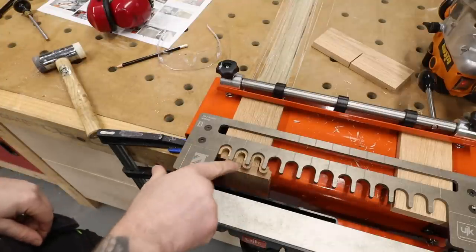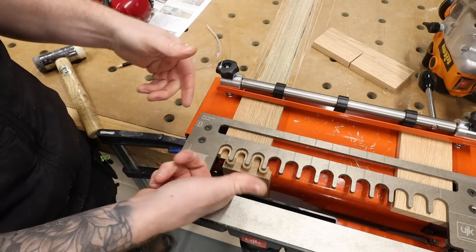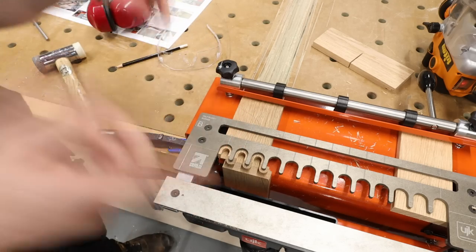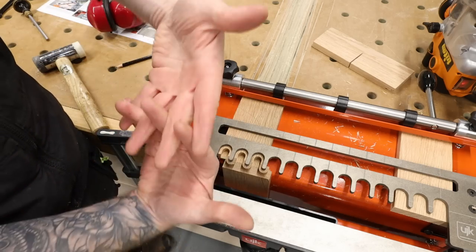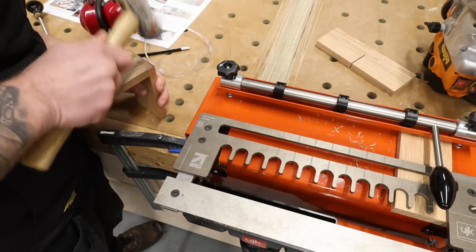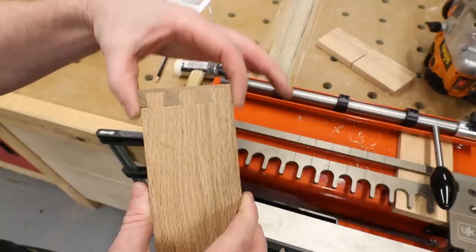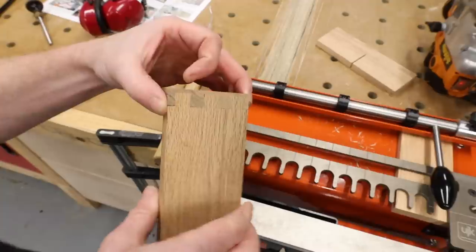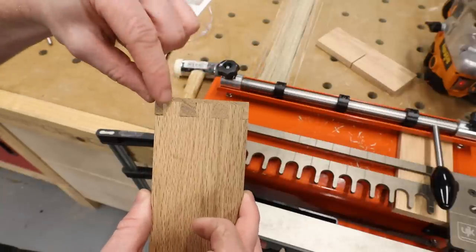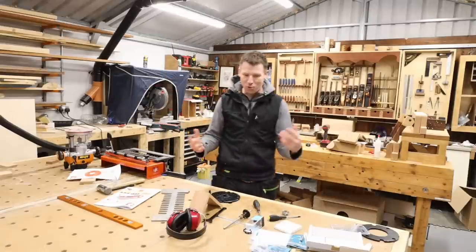Here are the results of the second cut. One thing to remember is that you're actually cutting the inside faces of the box — when assembled it goes together the other way. The edges of the box are now perfectly in line. Much better this time around — really nice fit — and the joints are very tight indeed. Happy days for the half-blind dovetails.